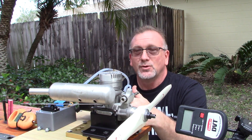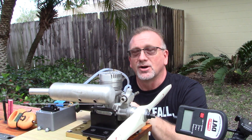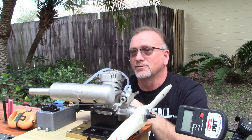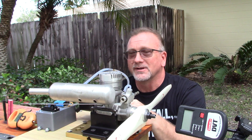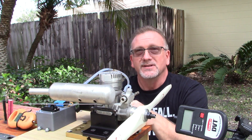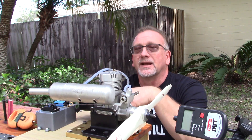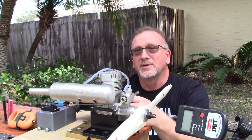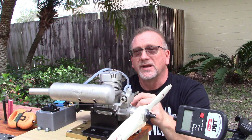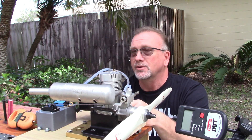Instead of doing a calibration, I looked at the last static thrust video I made with this Aviastar 150 engine. Since the first iteration of the static thrust stand seemed fairly accurate, I figured I'd just run this engine and compare static thrust readings to what I get today versus what I got on the last one. The only thing I'm doing differently is running a different fuel, but as long as the reading at a certain RPM is about the same, then I'm going to say that the calibration is good on this.